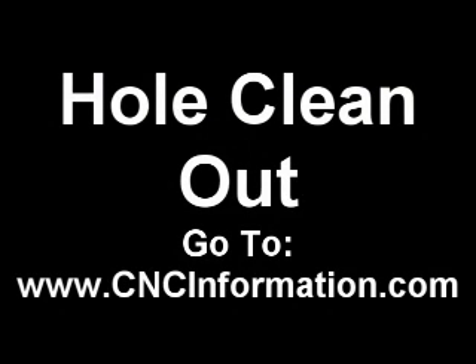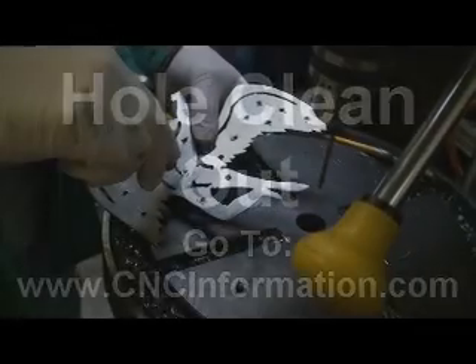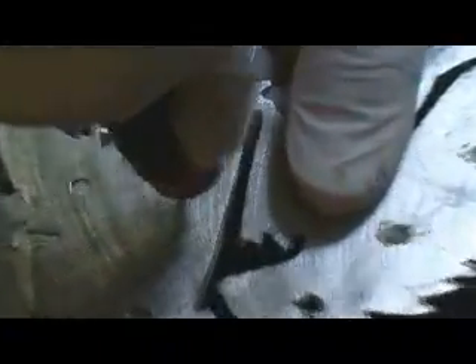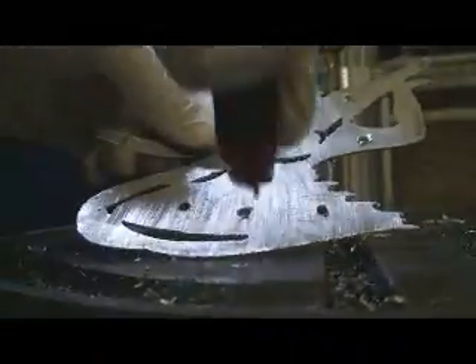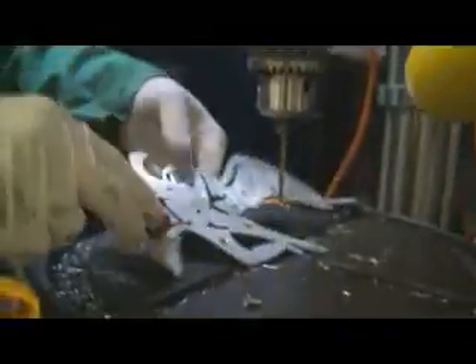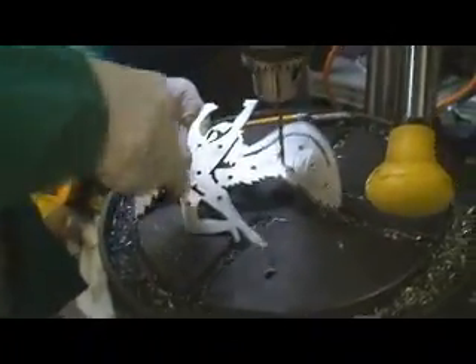Now next we have to clean that up. Those holes that we drilled — aluminum is pretty soft and it pushes out or extrudes out the back, and we're going to need to clean that up. So I have a deburring tool. This is a pretty common tool if you're a machinist in any way, shape or form. You take off a lot of machined edges with this. They're about $10 and you can get them anywhere. You can clean out holes and edges of machined parts — it just cuts that little lip off, makes it a little bit safer to handle. I'm using it mainly so I don't have to re-grind all that aluminum that's sticking up there.